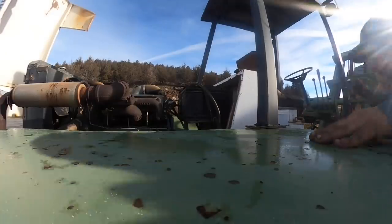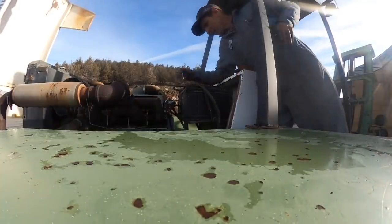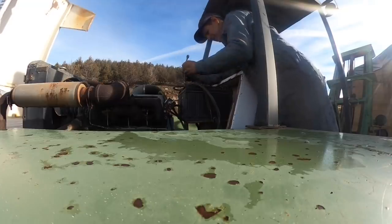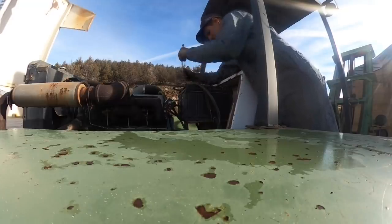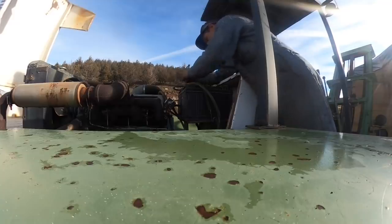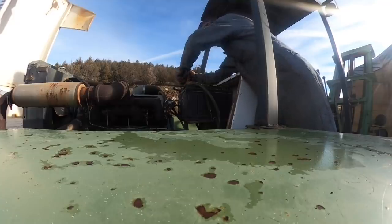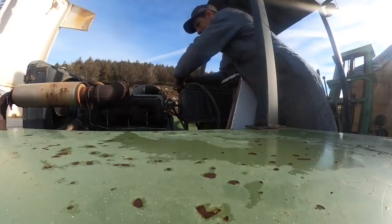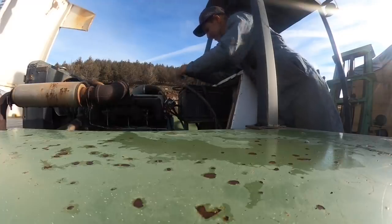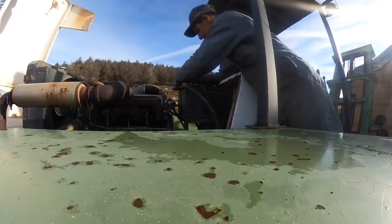So I ended up using the batteries that I had. A couple old Group 65 batteries that I had pulled out of some customer's pickup and replaced with other ones and never took the cores back, and I put them on the charger this morning, and then just for like 10 minutes, and then just checked the voltage on them and put my little carbon pile load tester on them, and I thought, shoot, those will work to get this thing going. So anyway,